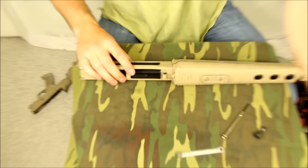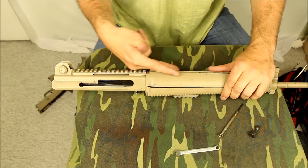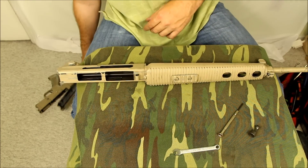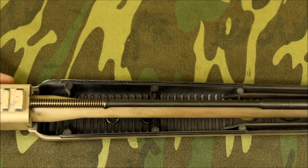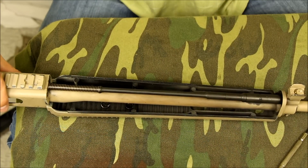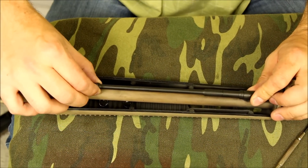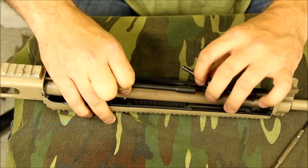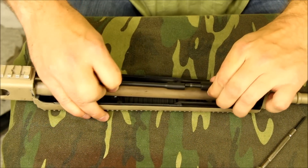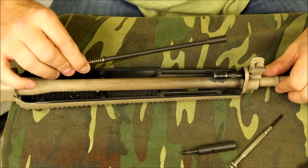Now that my upper and lower are separate, I'm going to move the lower off to the side. I'm fully disassembling because I'm getting ready to repaint this thing, so you'll get to see the whole kit and caboodle. The guide rod assembly had those two fingers poking in here and they just pull this upper forend right off. You can see those holes there that the guide rod fit into. This gas system really reminds me of the SVT-40 — it's almost exactly like it, except it's got three parts here instead of just two, and it's a nice straight-line recoil system. Let's get that middle piece out there — there goes that piece and that piece comes off. Just wiggle them around.